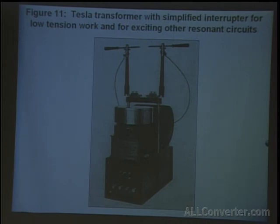A similar oscillator with hermetically enclosed mercury brake. In this machine, the stationary parts of the interrupter in the interior of the pulley were supported on a tube through which was led an insulated wire connecting the one terminal of the brake while the other was in contact with the vessel.